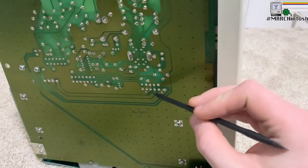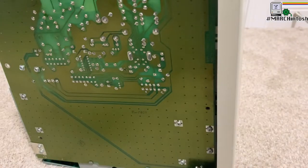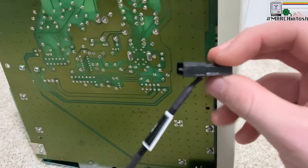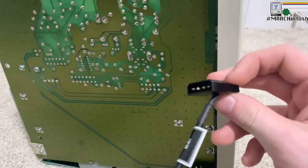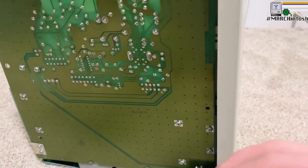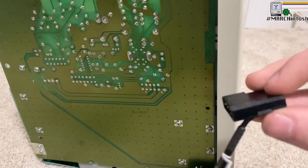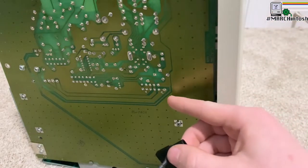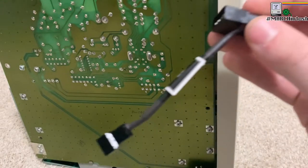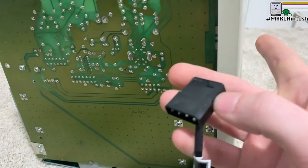You may be asking why I'm going to leave these just not attached to anything. Well, with this adapter I can make it work with a Molex connection, which is pretty standard on pretty much all PCs — or at least used to be. And it is present on this board over on the other side. So I'm just going to desolder the fan from these points and then wire up the fan using the Molex connector. Let's go down to the garage.